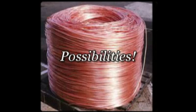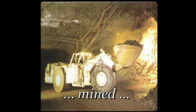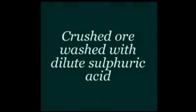This metal can be used in a variety of ways. How do we get the metal out of the rock? Well, one way of doing this is by something called solvent extraction! After a mineral ore containing copper has been mined and crushed, the ore is piled into a heap. The stacked ore heap is washed with a dilute sulfuric acid. The copper dissolves to form a blue solution called copper sulfate. But we want copper metal, not copper sulfate. Now this is where the real fun begins.